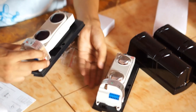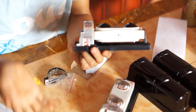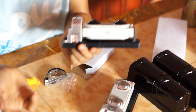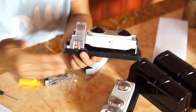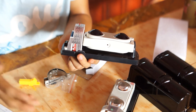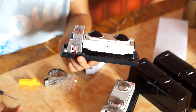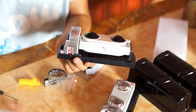Additionally, the most important feature is that the product has a DIP switch, which allows you to choose four different frequencies. The four channel frequencies allow the detectors to work more stably and detect motion more accurately. It can avoid cross-talk when you install multiple beams.